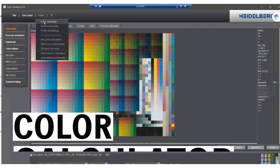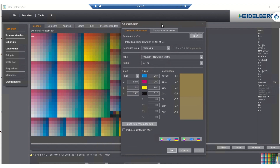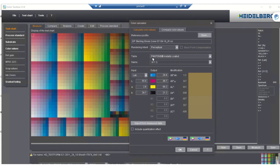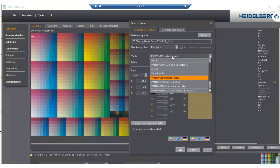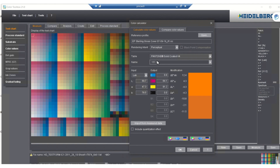One of my favorite tools that I use for digital printing is the color calculator. This tool allows me to add a profile of the device I'm printing on. With this tool, I'm able to see the delta E of a spot color before I actually print the color. The reason why this is so important is because the tool will tell us how close you can match different spot colors. For example, if the spot color has a delta E of 2, the color value will most likely match very well. But if the delta E is over 2, or more like a 5 to 10, the visual match will not be satisfactory to the customer.